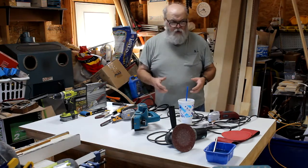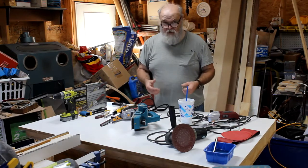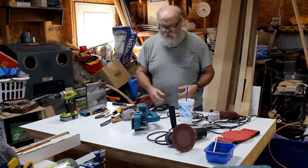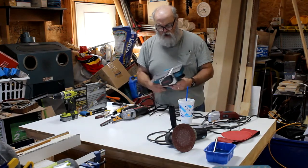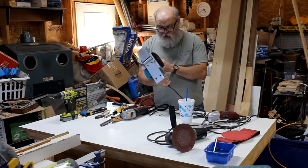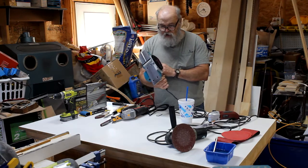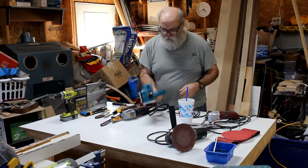What I'm doing is stiffening up the frames, bracing them up, and I have to start cutting various bevels. To get a whole lot of material off on some of those frames I can use this power planer, but I don't want to use it very much because it does take off a whole lot of material very quickly and you can make mistakes very, very fast. This happens to be a Makita, but any brand will do.